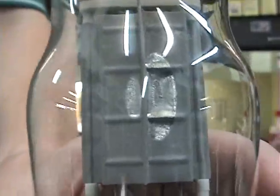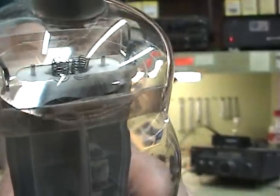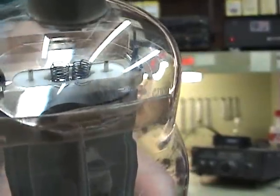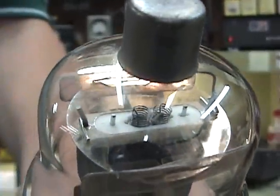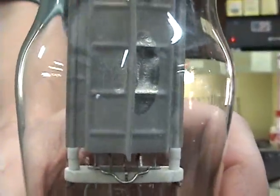Hopefully this will give you some ideas of what to look for when inspecting your tubes. In the top of the tube, you have two springs which support the filament. When you receive the amplifier or your tubes, always look to make sure the springs are intact, the plate is straight, everything looks all together, and you see nothing rolling around inside the tube.